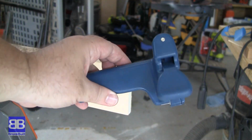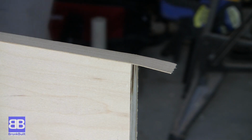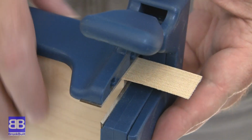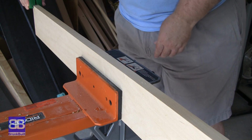Once applied, I give it a few minutes to cool down, and then I use my edge clipping tools to first take off any excess length, and then I glide down the sides to flush up the banding. These tools are pretty cheap and do a great job.